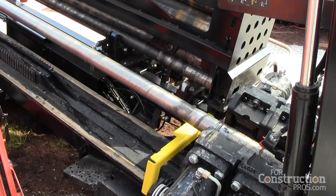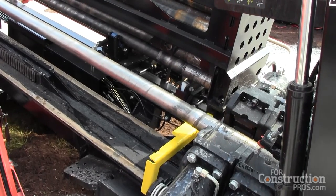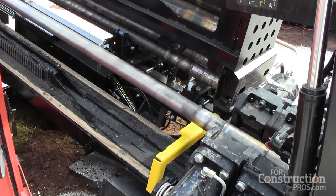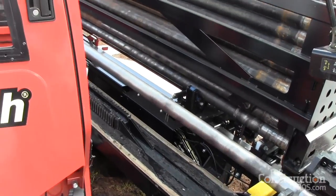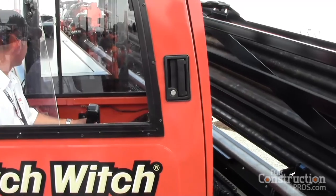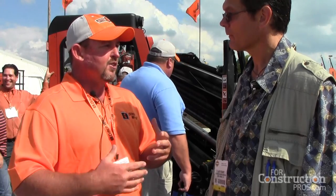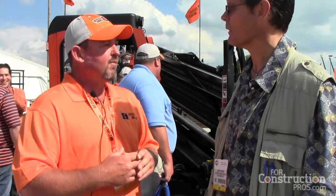And you mentioned the difference in investment — roughly, as a percentage of the 40 level cost, how much more would you pay for the JT60? When you're looking at a package price — mud system, drill pipe, say 1,000 to 1,500 foot, electronics, whole package — you're looking at about a 15% increase for a 50% improvement in capability. Relatively, yes — very close.